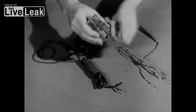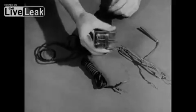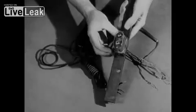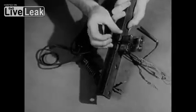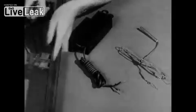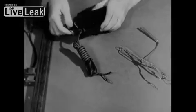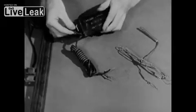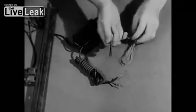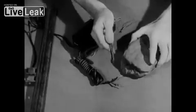The photocell, attached by magnets to its target, must be so placed that it can literally see the roadbed. Sensitized by light, this cell builds up an impulse from an accumulation of daylight, and when this light is suddenly removed — as happens when a train goes into a tunnel — the impulse is released and transmitted to the relay unit, where it is amplified into a charge sufficient to detonate the explosive.